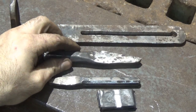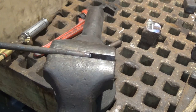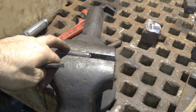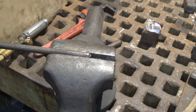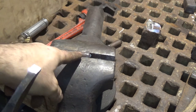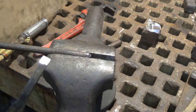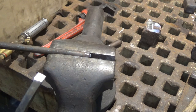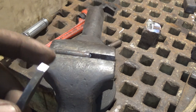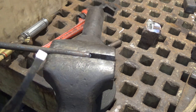So let's talk a little bit more about the cape chisel and I'll show you cutting a keyway. As an example, I have some half-inch mild steel in here, and I'll use the quarter-inch chisel that I used to cut the tool rest. Because this is flat and the top of this is round, it's only going to cut in the very center. So I want to cut deep enough in the first couple passes — I'm going to make light passes, make sure they're straight down the bar — deep enough to the point where these corners start to bite into the material. At that point, the cut will kind of be self-guiding.